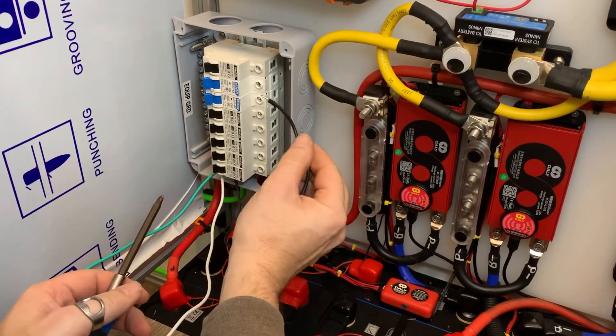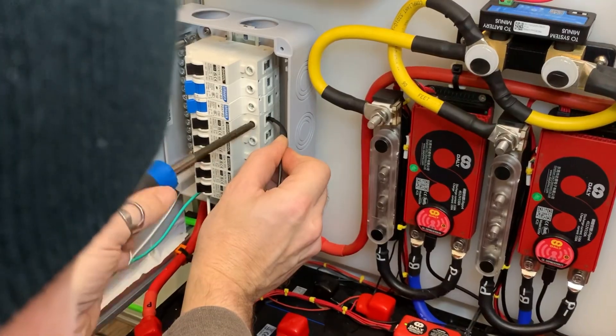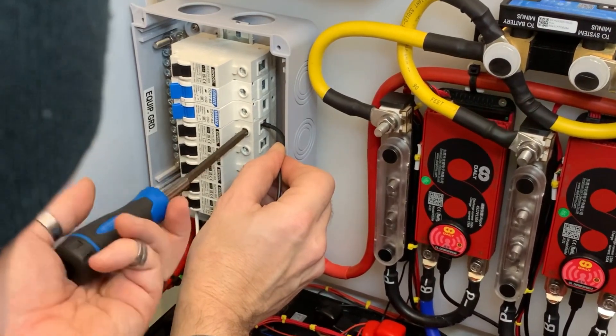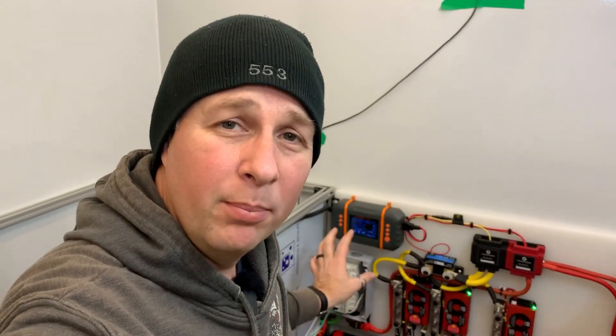Next, I take my pin lug, slip it into the breaker, and as I tighten the screw down on the breaker, it's actually drawing a U-shaped piece inside up to the screw rather than the screw bearing directly on the wire. Wiring up a panel in a pretty tight space like that and having it look good in the end is a little bit of an art form — it's never going to look good in the beginning. Stranded wire is always going to move around until you get everything in place and zip tie it together at the end, so don't judge me on what you see in this video; judge me on what you see when the panel's finished.